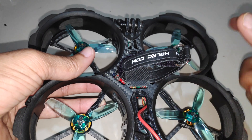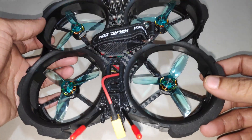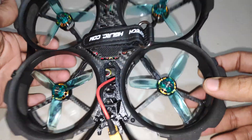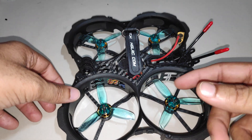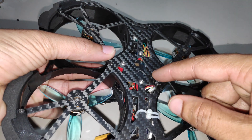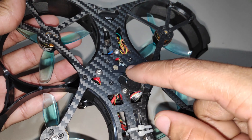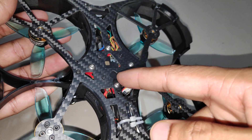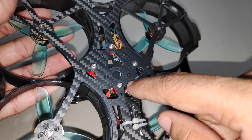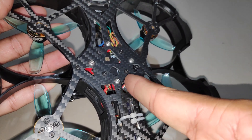The receiver, motor protocol, and various settings are all configured in Betaflight, so all I have to do is arm the quad and fly it. It was fairly easy to assemble. The main trouble was with the USB adapter — it connects to the USB port of the flight controller, but because the USB port on my flight controller is on one side, I had some difficulty installing it. I used my soldering iron to make some space around the corner so the adapter could fit.